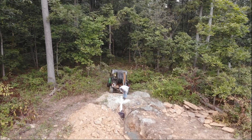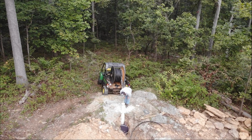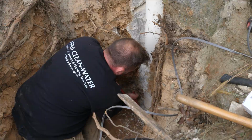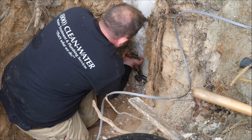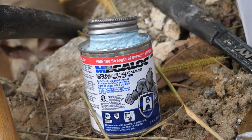If you haven't heard the term pitless adapter before, it's just a metal part that allows a sealed 90-degree connection between the underground horizontal pipe and the vertical pipe going down into the well. This allows the vertical pipe and pump to be pulled independently of the horizontal pipe. In the past, this connection was made in a dugout pit, hence the term pitless adapter.